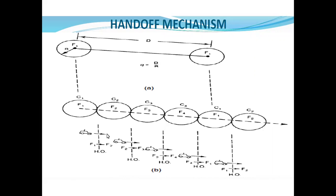There are two kinds of handoff. First is hard handoff, which means break-before-make. If I am going from f1 to f2, it will first break the connection with f1 and then make the connection with f2. So the breaking procedure is done first, and then the making procedure is done with the new frequency.